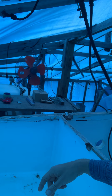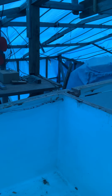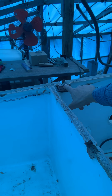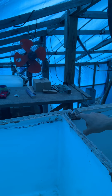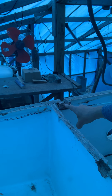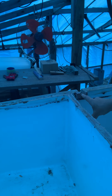Now, the builder violated a few principles of this design in constructing this boat. He used a 12mm plywood skin for the upper fairing, and this upper skin was essentially cut through to facilitate the entry of these transverse forward-to-aft positioned drains. These forward-to-aft transverse drains cut into the upper fairing skin, violating its structural integrity in several areas. He used PVC tubing for hatch coaming drains, and this is not the best practice.